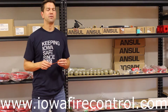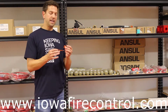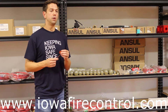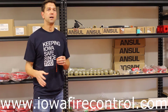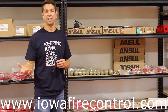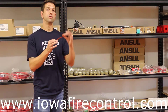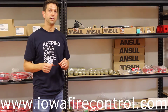Another thing we do when we come in for semi-annual maintenance is we'll go ahead and make sure that all of these are fastened on. If we find any that aren't, what we'll do is discharge the system through nitrogen or dry air — not with an actual cartridge — but we'll hook up to the union on the tank and blow through all that distribution line to make sure that it's clear.